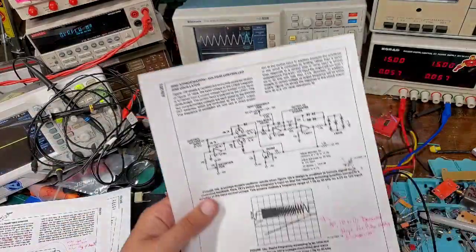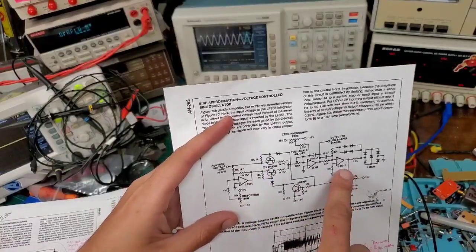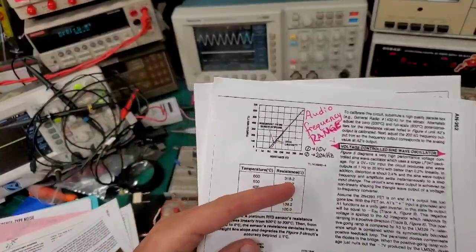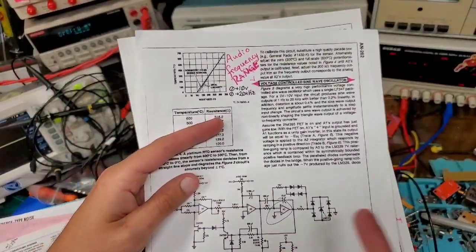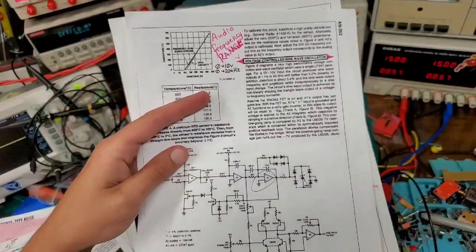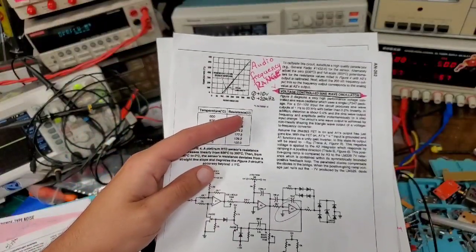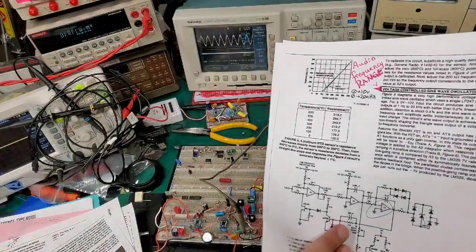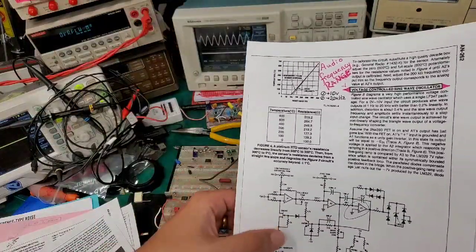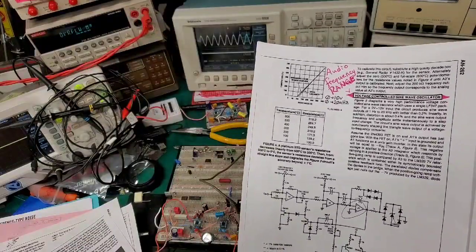All right, here's another way that he does it, by just using 2 JFETs and actually an actual comparator instead of just using a fourth op amp. The fourth op amp is one because that's all this is doing right here. It's comparing as soon as the voltage gets to the threshold, which is set by this here. I didn't use an LM329, I just used a 5 volt, maybe 6 volt Zener, and yeah, works a treat. I had to change the value of this. I changed the value of that resistor there. I had to wait to get the 4393 and the 2369 transistors, the JFET and BJT, respectively.